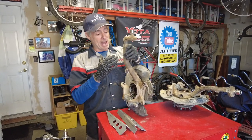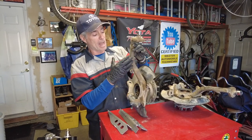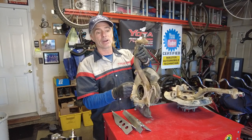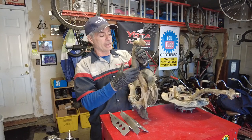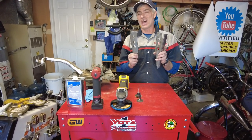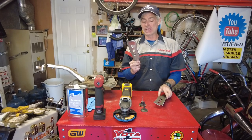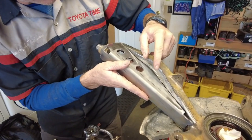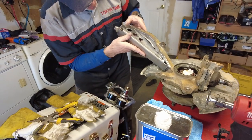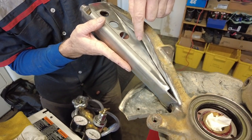With all that said, we're going to get these cleaned up. We'll use abrasive pads to strip all the corrosion and paint to get nice, fresh, clean metal to weld on. We're going to use a DeWalt angle grinder and a Milwaukee quarter-inch die grinder. One thing to note about these Total Chaos gussets is they're not exactly a perfect fit. So we did a little grinding in spots, fitted the gusset onto the knuckle, saw where there was a high side, ground off a little bit, and kept at it until we got a much tighter fit. As you can see, we cleaned off all the metal really well so we get a good weld.